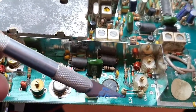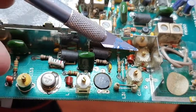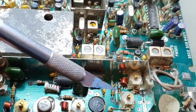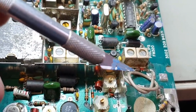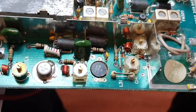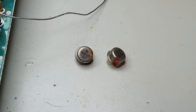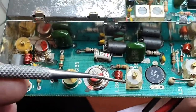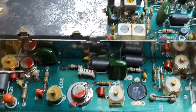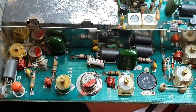So there's the BLX68, the 1N4148 done, and those two diodes there. I'll start reassembling now. Whilst I was here I also decided to replace the MRF629 — both of them — because it's so hard to get back to them, so I put in some fresh ones. That looks like being complete now.